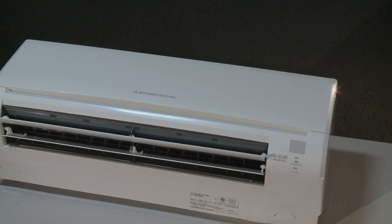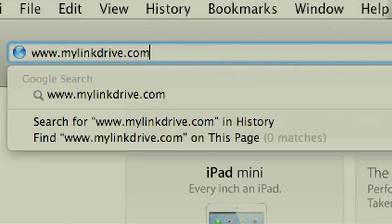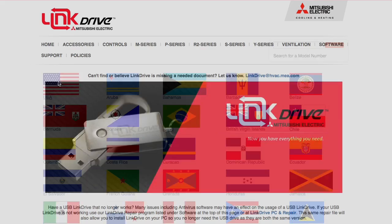If we still have the same voltage at the S2 and S3 wires that we have on the outdoor unit, the control board on the indoor unit would most likely be the cause of the communication error. On indoor units with multiple control boards, go through the checks that are available at mylinkdrive.com to be sure you get the correct board needed.